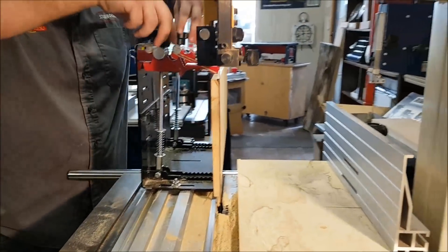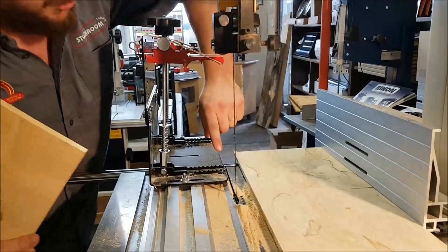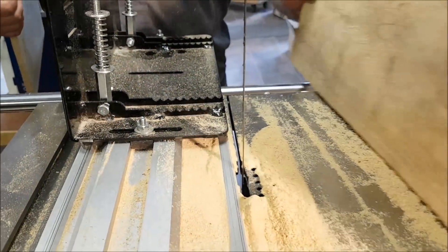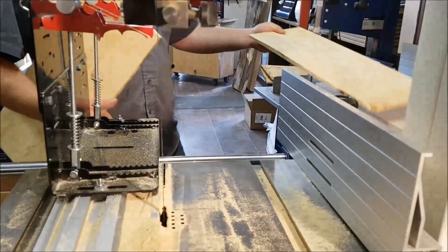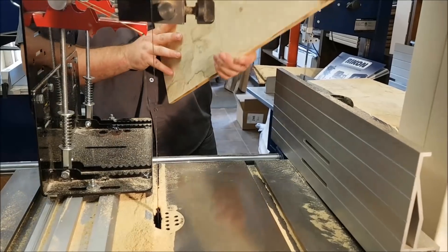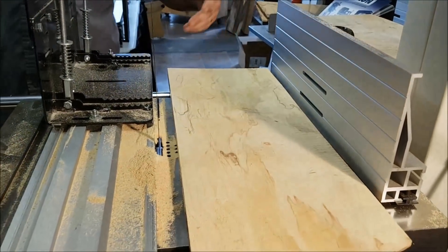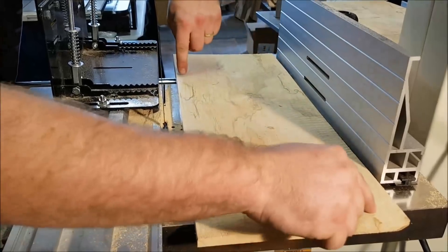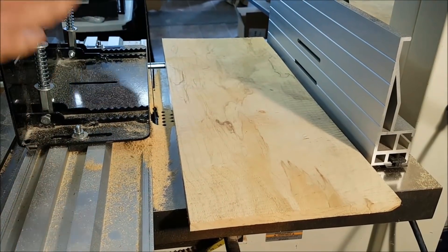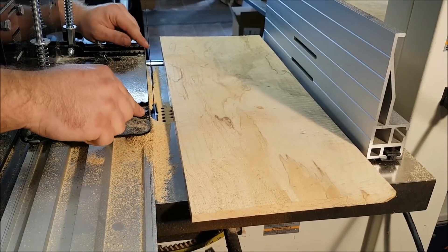How come? Pretty simple. Let me loosen it off here — you might see it right away. As soon as I loosen it, each one of these claws is holding by four different points — eight in total. As soon as I take that out, basically what I've done is turned this piece of wood that was perfectly sturdy back into a piece of wood that is free to twist. You look at that right there — it's not flat. Every piece of wood I clamp in the jaws of the Little Ripper is going to stay straight; it's not going to move until you release it from the claws.